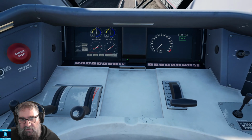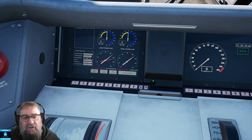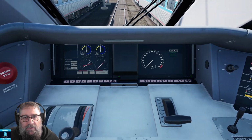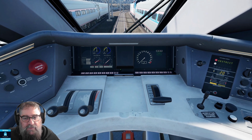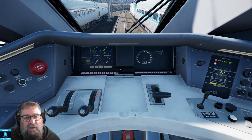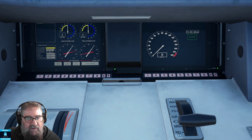So I've put that back to the release position down there. And let's go back in. Okay, the red needle's gone to 0 and the equalizing, the white needle, has gone up to 110. It's the left-hand white needle, I should point out for you. Alright, so we're rolling again. So let's just apply minimum again and see what happens. There we go, straight up to 20 pounds, and we took 10 pounds out of the equalising. Let me zoom in again, just enough so you can see both.